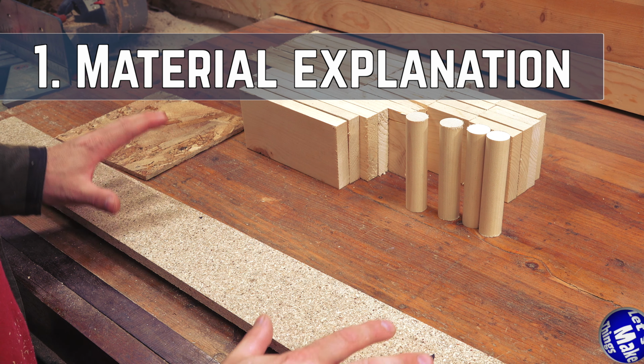All right, this is probably the most crucial step right here, and that is we're going to glue the center piece in here. You'll want to find the flattest surface that you can, and we're going to glue this together. Now, we'll add our plate temporarily as a spacer at this point. Again, all 4 boards that are on the same plane are down. I've got my arrows that I made earlier pointed down like this. Right now, we're just going to focus on the center piece here. We're going to glue it and then allow it to set. We'll give it a couple hours before we do anything else.